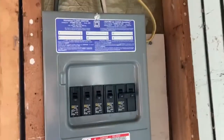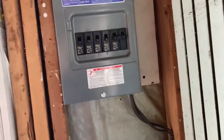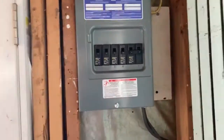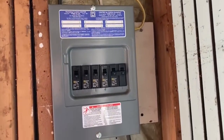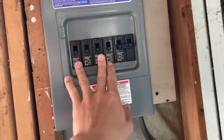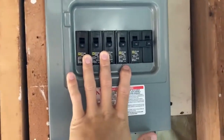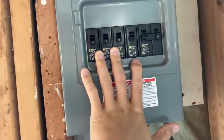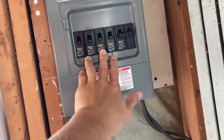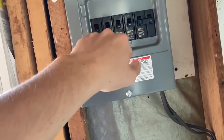I figured I'd mention really quickly, guys, that this is actually the completed sub panel. I know at the end of last video we showed how to wire a couple circuits. I did go ahead and, off camera, just finish that up, since it's pretty much the same thing over and over again. We do have 4 circuits that we really probably didn't need, but since I had the room and had 4 different things, I figured why not. If we need to someday, we can always switch 2 of them and put them on the same breaker, or we can do a double breaker with separate circuits.